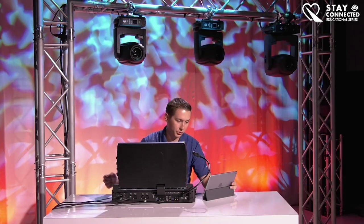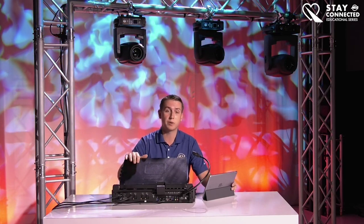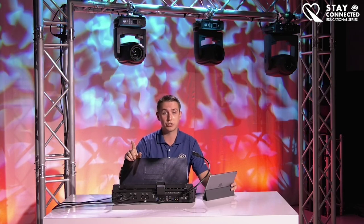That's a huge dramatic difference from the snap off we saw without a dimming mode. So if you are having dimming issues and don't like how the unit is dimming, look at your beam effects. I'm using the Obsidian Controls NX2 and this is under beam effects where I can choose my curve. For theatrical or church environments you're going to want a nice slow fade out, while other times you may want a nice snap off. That kind of concludes the 4Z.